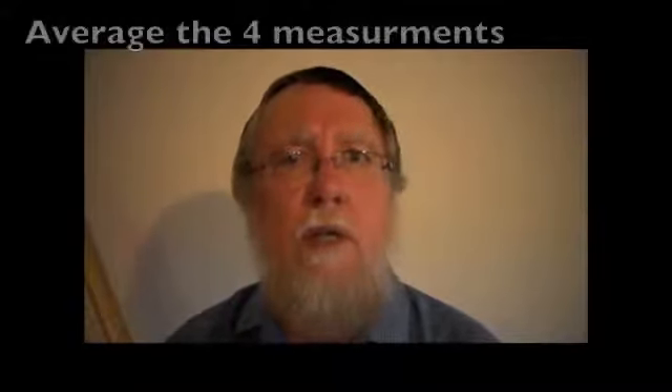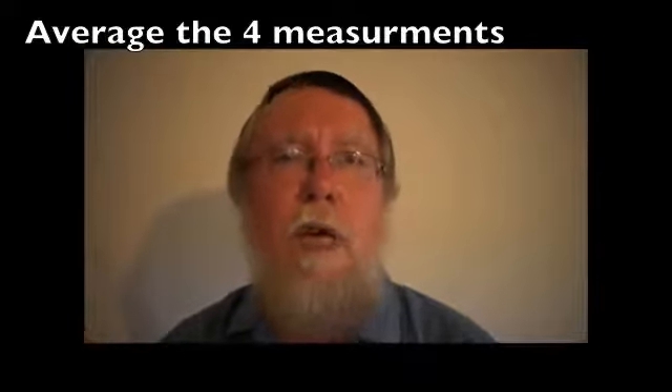When you've got those measurements, average the four of them. Then have a look at the average value to the third decimal place — round it to three decimal places. Look at the variation with the four individual measurements, find the most different measurement from the average, and use the difference between your average value and that measurement as your uncertainty. Have a look at how big that is — you might be surprised.